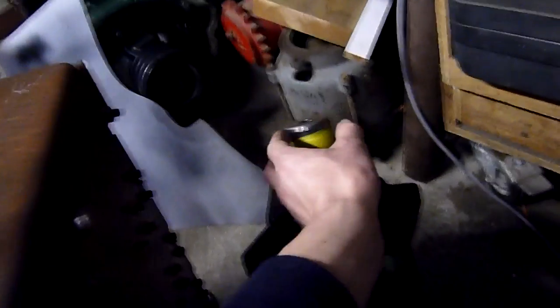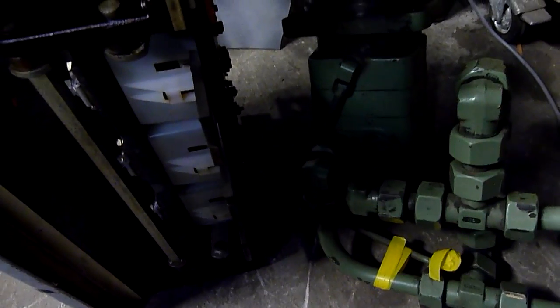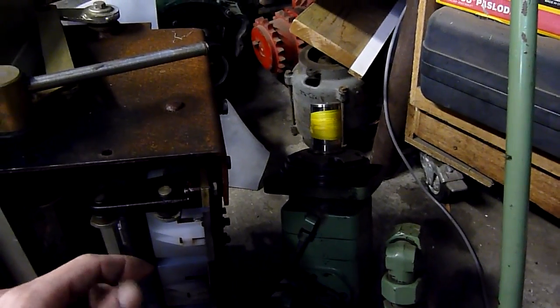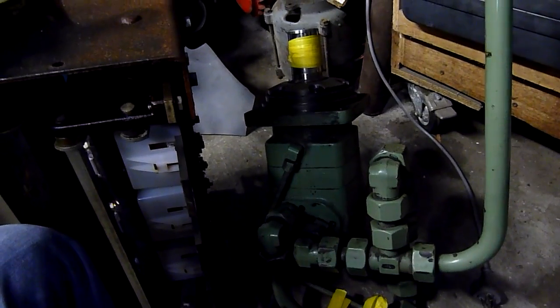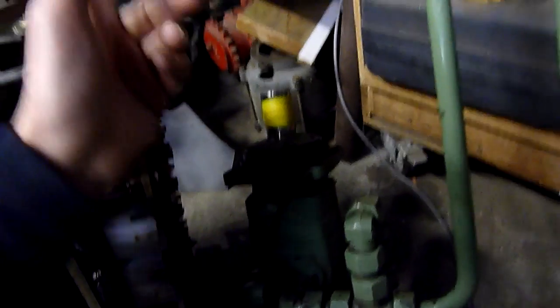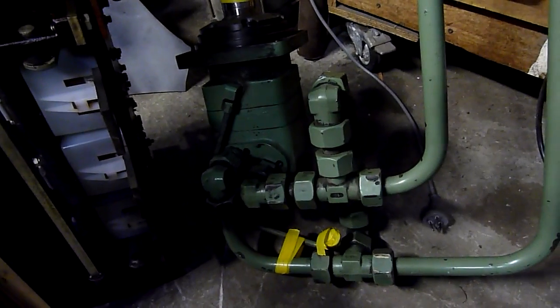I know I'm talking imperial again, but you don't measure this stuff in metric. None of this stuff's measured in metric — even though it's made in Germany, I imagine it's all inch. All the hydraulic stuff — I've never seen hydraulic stuff measured in metric, apart from output shafts and input shafts. It's got check valves so I'm turning against back pressure. It's got loads of torque — I think it's like 240 Newton-meters of torque at 600 RPM. But if I feed high pressure but lower volume, I should be able to get that speed right down. There'd just be a torque curve as the cutter comes down on top of it, it's going to build back pressure. It's not 100% practical, but I think it could work.